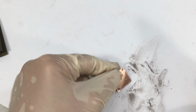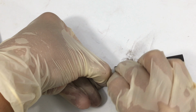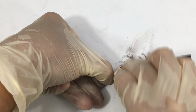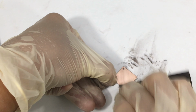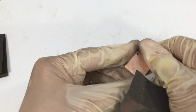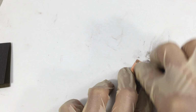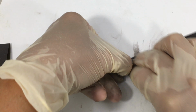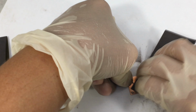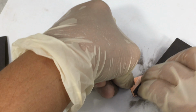And so once you do the 600 grit paper and you have that smoothness, again on this piece I didn't have to do the 400 because I didn't have any deeper abrasions on the surface, so I only have the 600 grit. And then I'll file the other side. Now remember, we cleaned up the flange from the holes by using that round burr fitted in the pin vise, and so it's a little bit easier to sand across those holes.